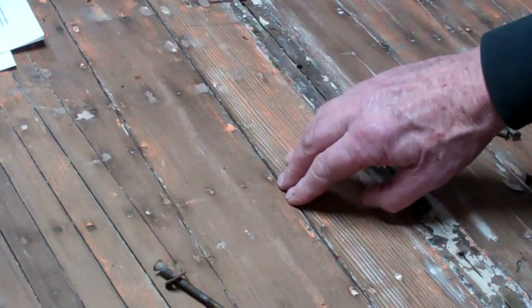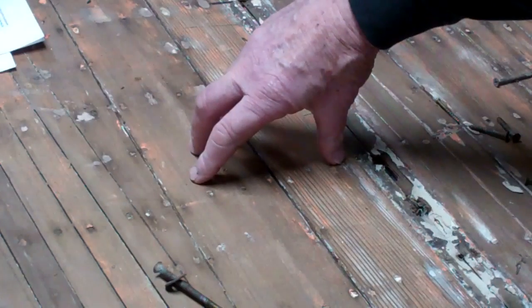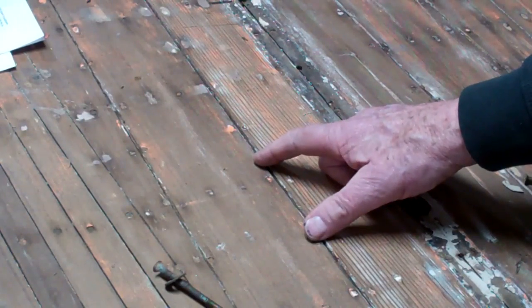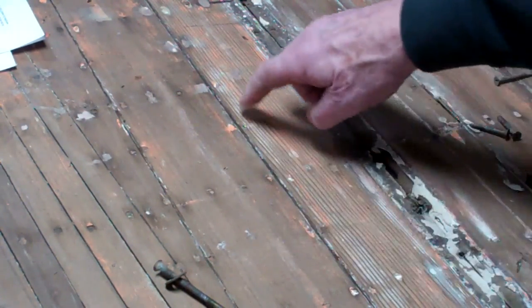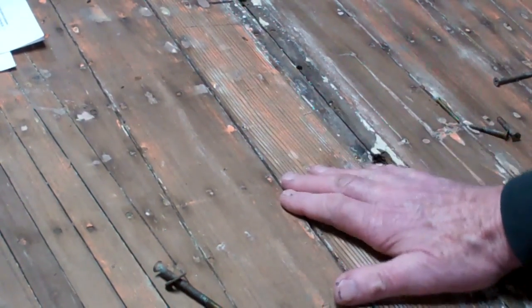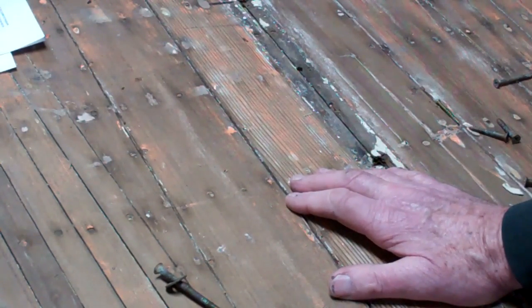Paying 5200 into here just creates a nightmare, because once it's cured, it can no longer compress. So should these two boards become wet and expand, since the 5200 cannot compress and take up some of that expansion, you run the risk, especially in a boat that has cedar planking on the bottom, the planks just get compressed, they break, they bow and buckle.